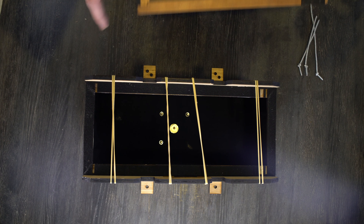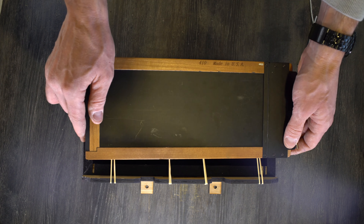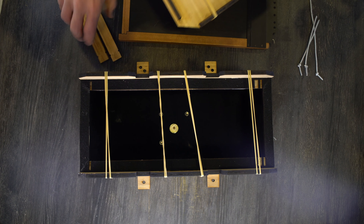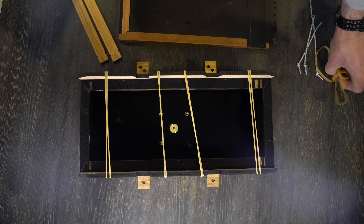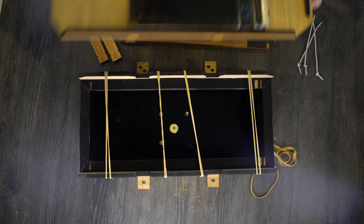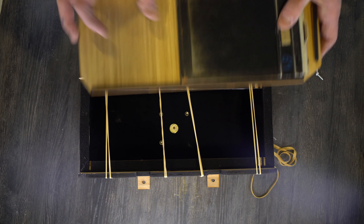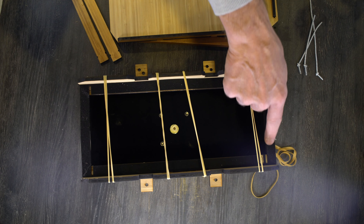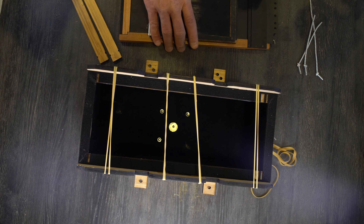The way this works: the 4×10 can only be loaded top-down. This wider notch is where the 4×10 light seal rests. When this camera is used as a diptych, the 4×5 gets two 4×5 holders. The 4×5 holders go in here — their little bevels line up with the gasket here and there. That's why this specific shape is the way it is. It was much harder geometry to design than it should have been, but it's done now.